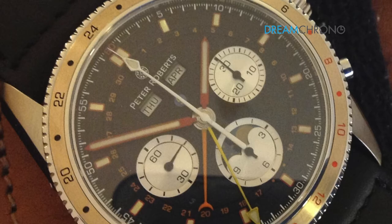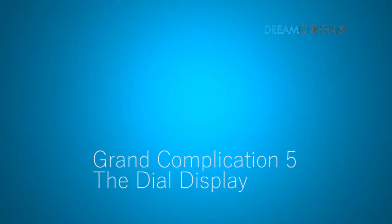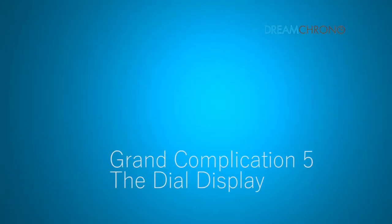You might say it can scratch. So what you do is try to design it in such a way that the parts that would scratch are protected by other parts. On the Concentric case, I have a bezel which uses a very hard beryllium bronze on the bezel insert, and the way the bezel is designed, it pretty much protects most of the case. The sapphire glass is also very protective — there's a lot of glass and not too much flat surface at the top exposed. And it has a hardening treatment and anti-reflection coating, which is the best the Swiss watch industry can do.